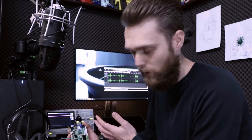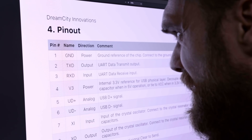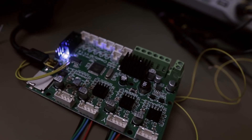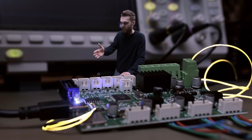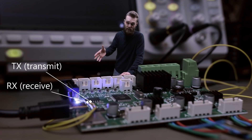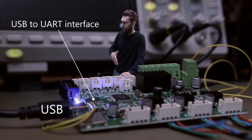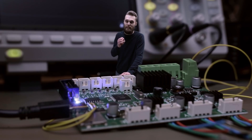The microcontroller of this board still works, so we can use this to write our software with. I've soldered two wires to this USB to UART interface. The two wires lead up to this oscilloscope, and I've connected those two wires to the RX and TX lines of this chip. It's a USB to UART interface — the USB side goes to the computer and tells it that it's a serial port, and the UART interface goes directly to the microcontroller. Those are literally the ones and zeros making up the code that we are going to send to the microcontroller.